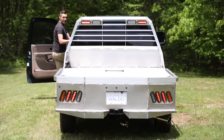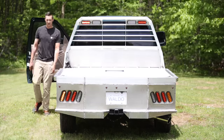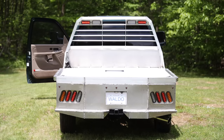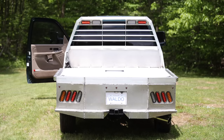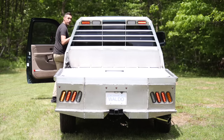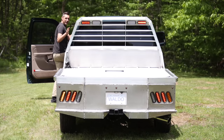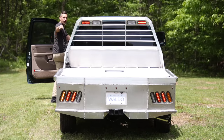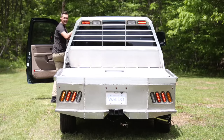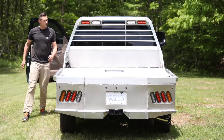So that's what the brake lights look like. I would imagine you can see those. There's the left turn signal. The colors probably look a little bit washed out because the lights are so bright, but from here, it looks pretty good to me. Now, what's really interesting is that when the turn signal is on and I put my foot on the brake, you can see that the lights actually alternate. That's kind of interesting because that tells me how the converter is implemented, and it's really just a simple exclusive OR gate inside.